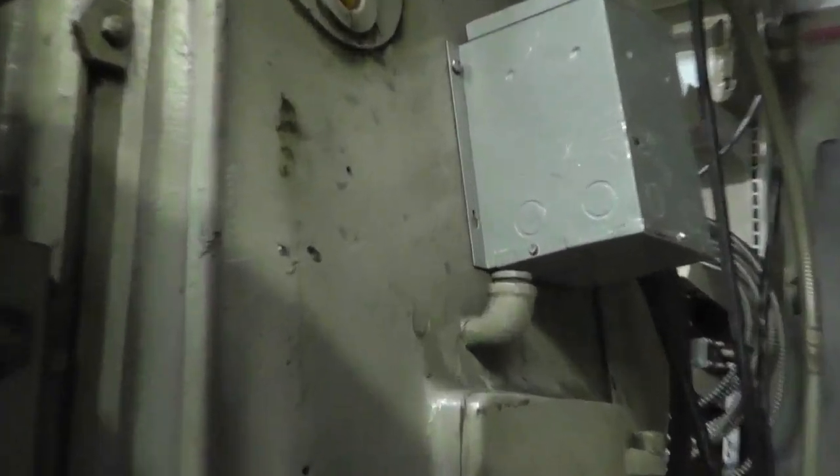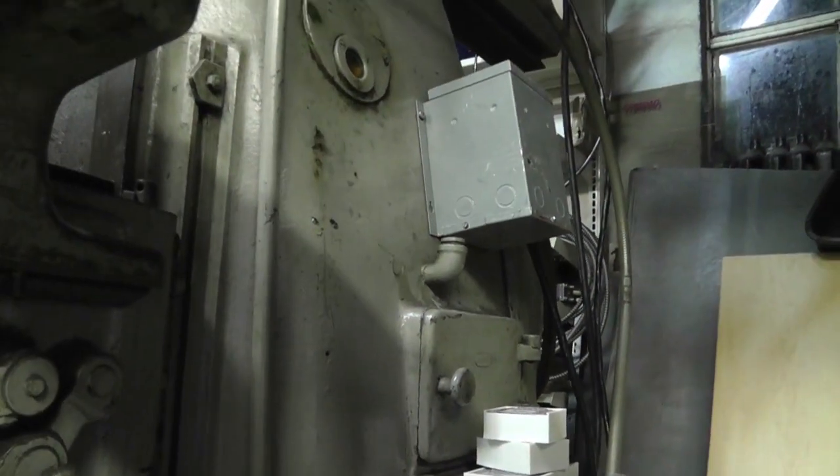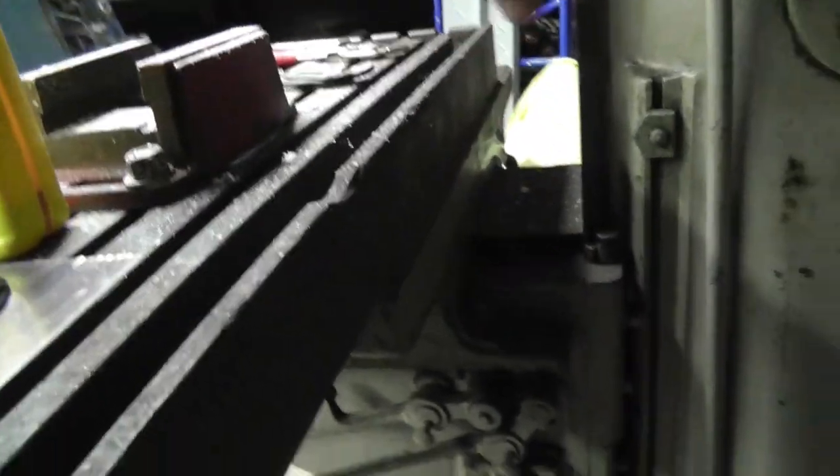There's the good machining oil inlet, which I need to open and look in. And obviously that stuff flows back down here and gets pumped back up this tube and out and about to the end, and that's where it all actually drains. All the inside cuts are actually cut so the oil drains, and it drains to the center, then it drains down the back and somehow makes its way through the machine back down to the bottom. I'm actually not quite sure where the machine oil comes back in. I'm assuming it flows in this channel, which you can't really see.